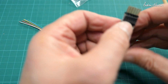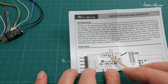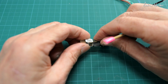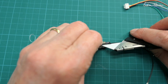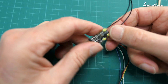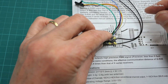In tiny writing on the board we can see negative, positive, and signal — the top is signal and negative is at the bottom. The 6-pin header provides: S-Port for the first three pins, then analog, A2 in, S-Bus out, and S-Bus in. To solder the plug on, you pull off the cardboard casing, remove the rubber band, and solder in those pins. I had to pick out a little bit of the glue holding the antenna on, but that's fine. Then we'll solder it up.